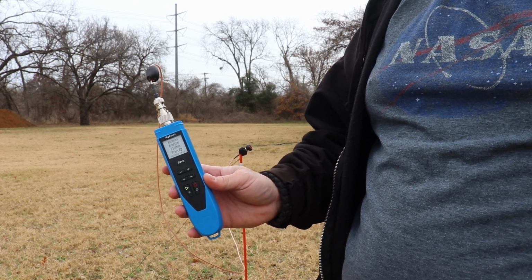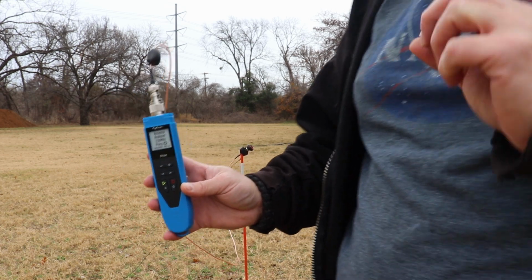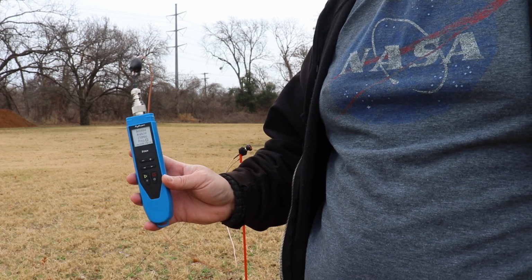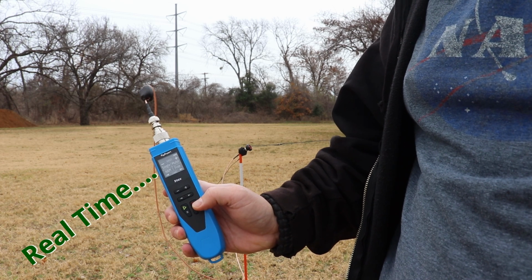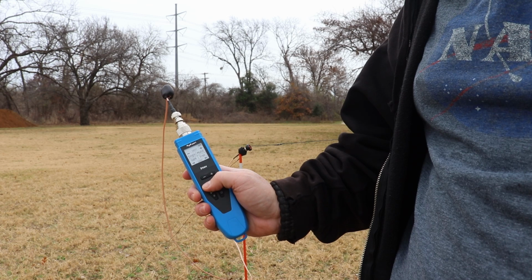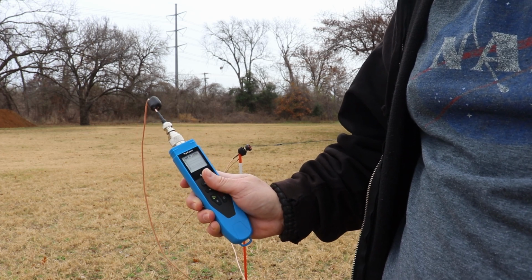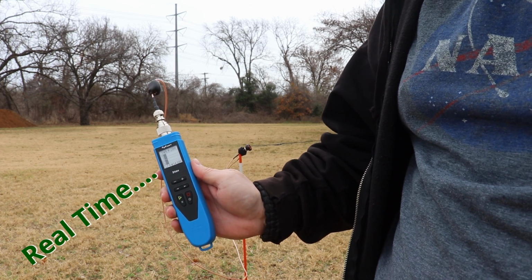This antenna should be good for 80 and below. Since it's a random wire, it's not going to give us a perfect 1-to-1 match, but it should be under 10-to-1. And if it's anything below 5 or maybe 8, the G90 should be able to tune it pretty good. So I'm going to go ahead and turn this on. Give it a second to wake up here. There we go. I'm going to say ham. And I'm going to change the band to, oops, wrong direction. 20, because that is where my home is.